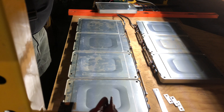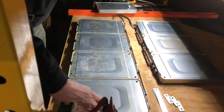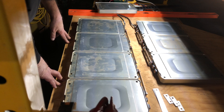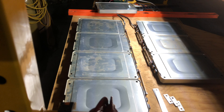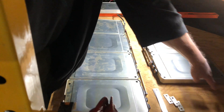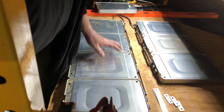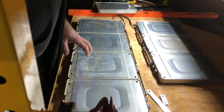If you're going to be out of power for a few days, this is my prototype setup. We're going to build handholds into the plywood backing so we can lift and hang it, put a cover over the top, and add a contactor switch, BMS, and circuit breaker in this empty spot — because we're doing a 7-cell series for 48 volts, not 8, which leaves room for all those components.